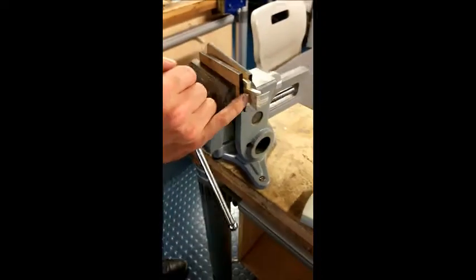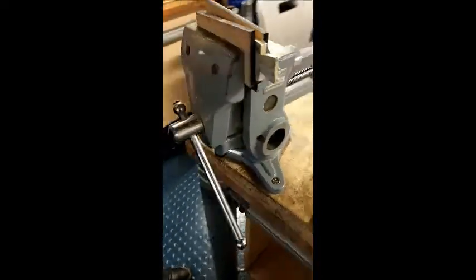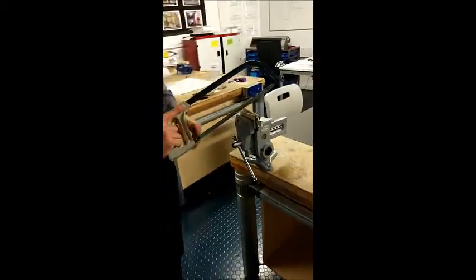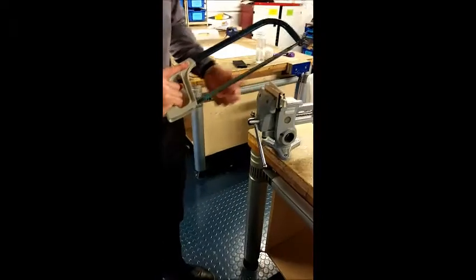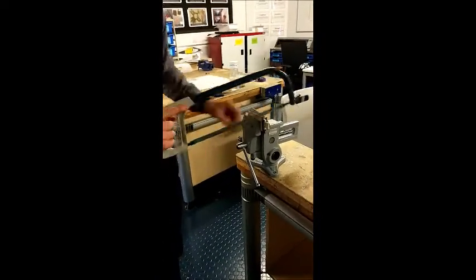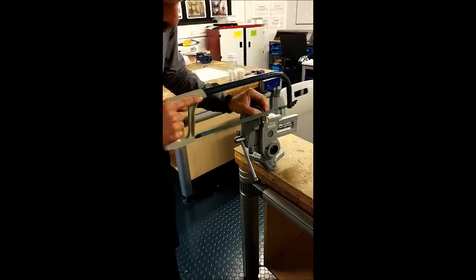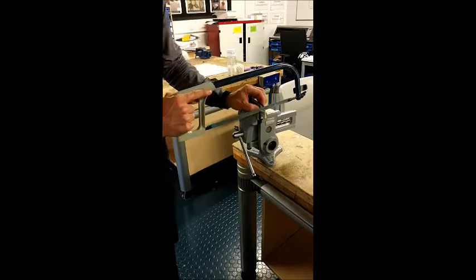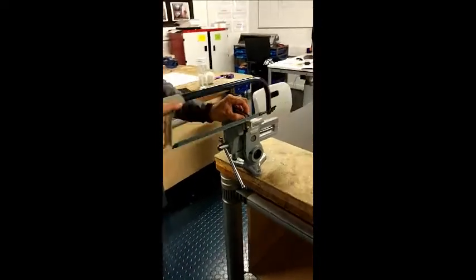If you come around this side you can see the sprue is just sticking out the edge over here. So just like before I'm going to use the hacksaw this time to cut the metal — the hacksaw is a better tool for cutting harder materials like this, as it's got much smaller teeth so it will cut a lot easier. I'm going to just do a little mark to make sure it doesn't move around, then proceed using the full length of the blade.